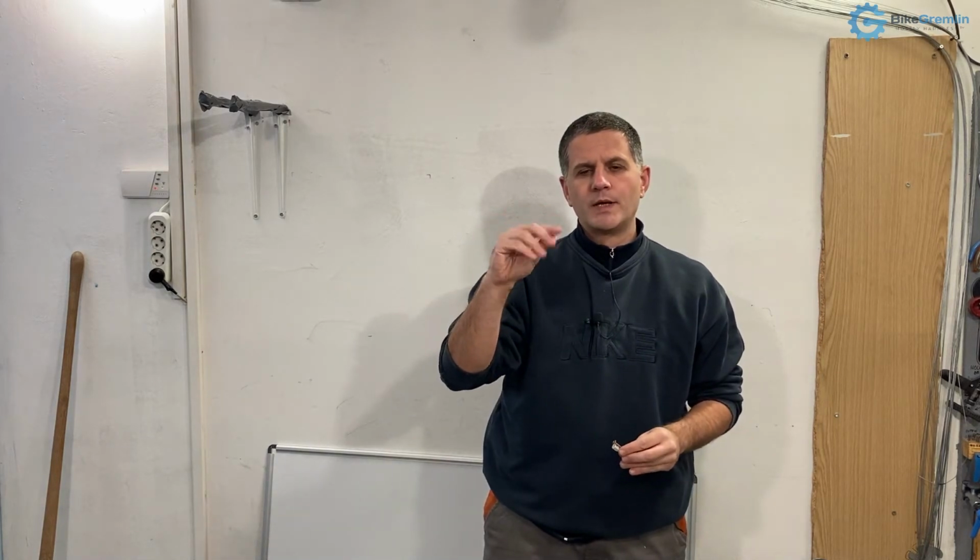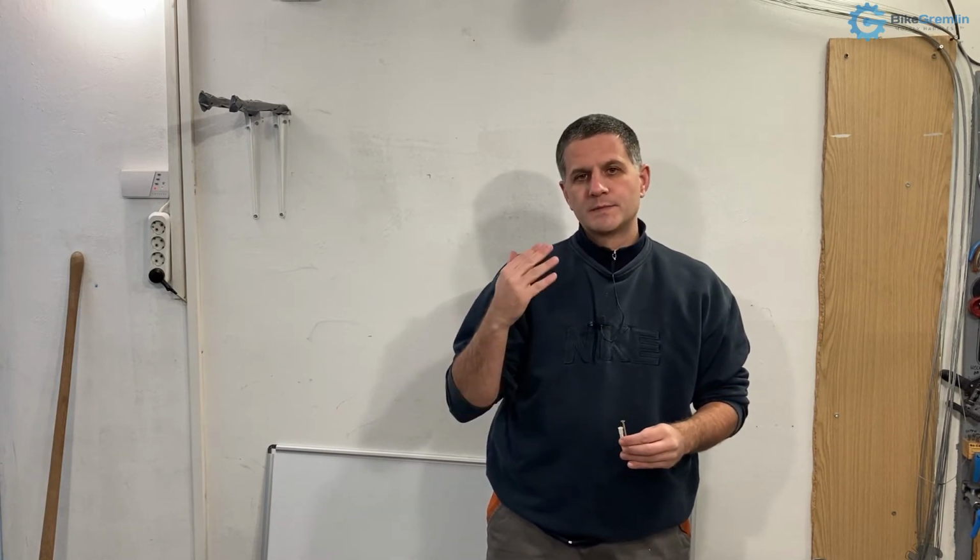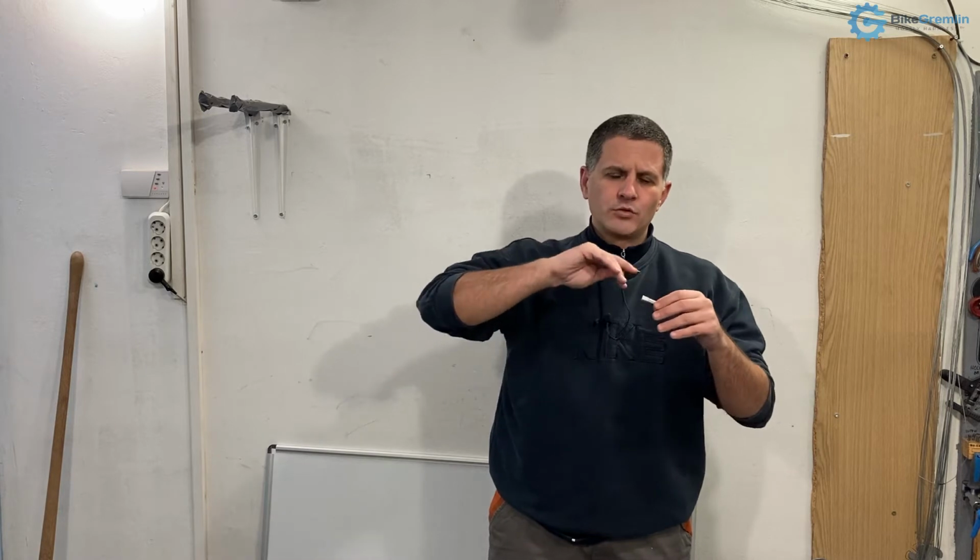When you're mounting something heavier, like bookshelves and similar, if a wall is of good quality, so it's not crumbling, 8mm dowels with 6mm screws work fine in most cases. And for just extra security or for some very heavy stuff, I like to use 10mm dowels with 7 to 8mm thick screws. So that usually works best, and there's no use in using a screw that is too thin for the size of the dowel, or using one that is too thick. You will have problems and it will not be able to hold in place.